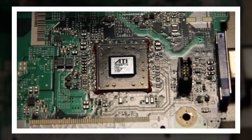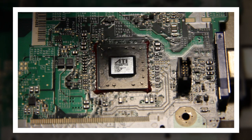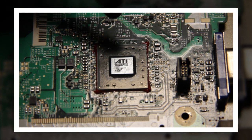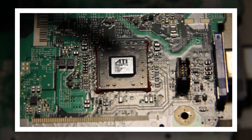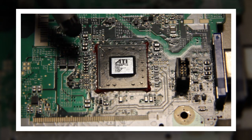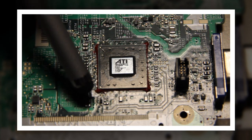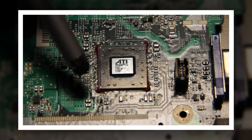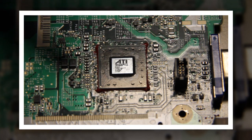Also when you put them in the oven, the whole board itself will actually warp — you're warping the different layers because the gold actually expands at different temperatures than the board itself. So what you're actually doing is not really even melting the solder, you're just warping the board and making it make contact. If you put the board hot enough — 450 degrees or higher — gravity is going to make all the pieces on the back side of the board fall off. Even using cardboard or a mold, you'll start loosening things, and all these little solder joints on the resistors and capacitors run the risk of becoming cold solder joints or not being seated properly. It's just a really bad choice to put these in the oven.